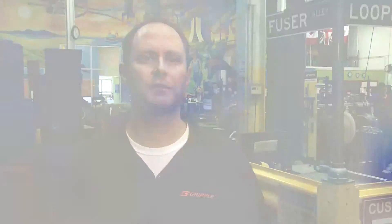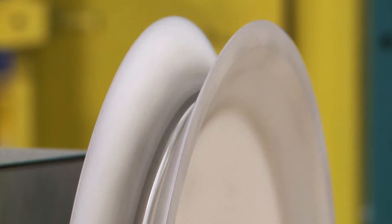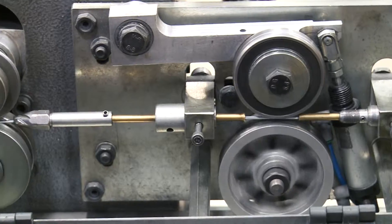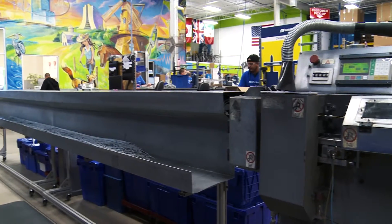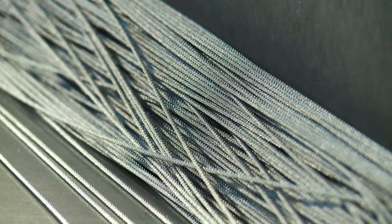We're here at the wire processing area of production. The wire process equipment consists of three main sections: a wire payoff machine, a fuser, and an expulsion unit with collection tray. The wire payoff unit delivers a nice steady even flow of wire to the fuser. The fuser then drives that wire, electronically measures it, and once it gets to the correct length will send electrical current through the wire, cutting the wire in half and providing a nice fuse on the end of the wire. Once the wire is cut it gets taken through the expulsion unit, goes through a chute, and drops into a collection tray for later processing down the manufacturing line.